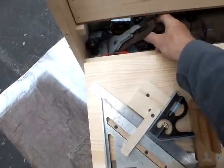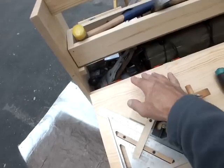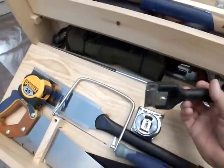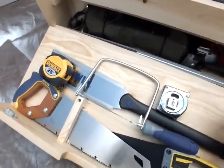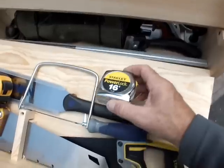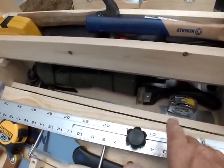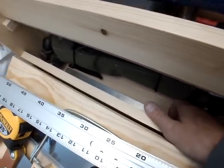I carry a two-foot level. I've got a Millers Falls — the economy model they used to have. The Millers Falls number four plane is excellent — those are as good a cutter as anything when tuned up and sharpened well. I also carry a paint scraper — you'd be surprised how useful that is. Learn to file those and sharpen them with a burr on, because they're great. I carry a smaller lightweight 16-foot tape, and a sliding two-foot T-square — like a drywall square but two-foot — that makes a good 90.